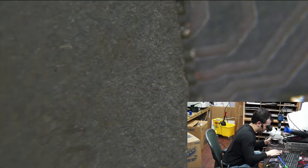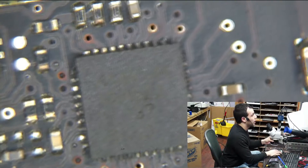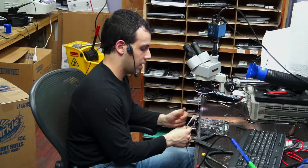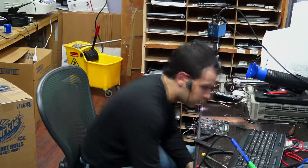If you want to troll me on how misaligned my soldering is, you're welcome to — I'm not claiming to be the best at it. I am not a micro-solderer; I am an electronics repair technician. I solder to get my job done. I think I'm a good electronics repair technician, but I'll totally admit I'm not a soldering expert. As I always say on this channel: if what I do does not work, you should not listen to me. The next step is to prove this thing actually functions. One of the things with this board is when it has no CPU vCore, it won't chime when it turns on — but when it does, it will chime. Not only will you see that it turns on, you'll also be able to hear it.